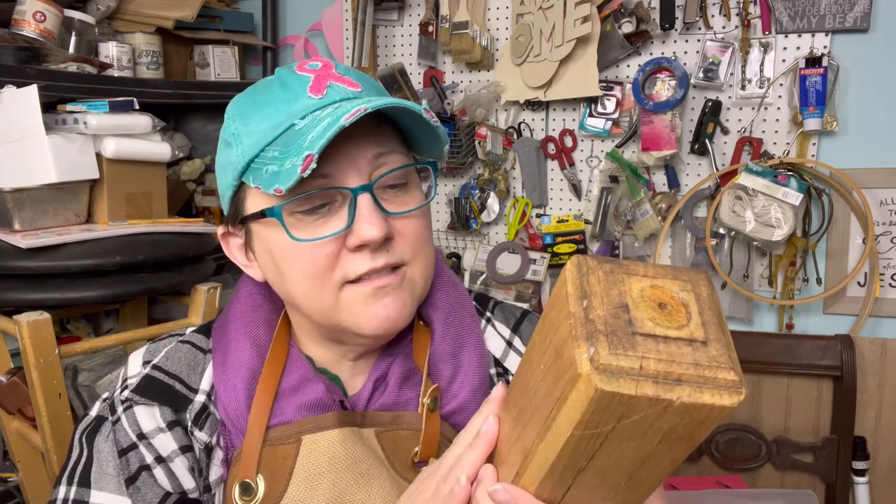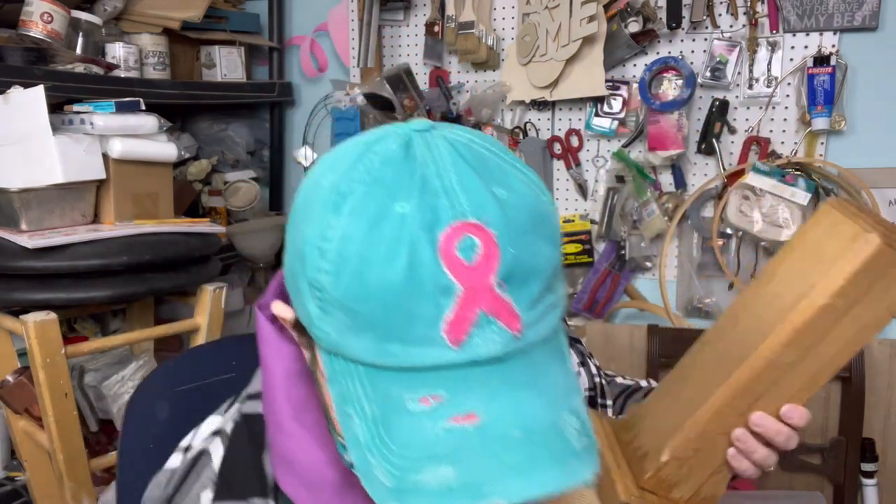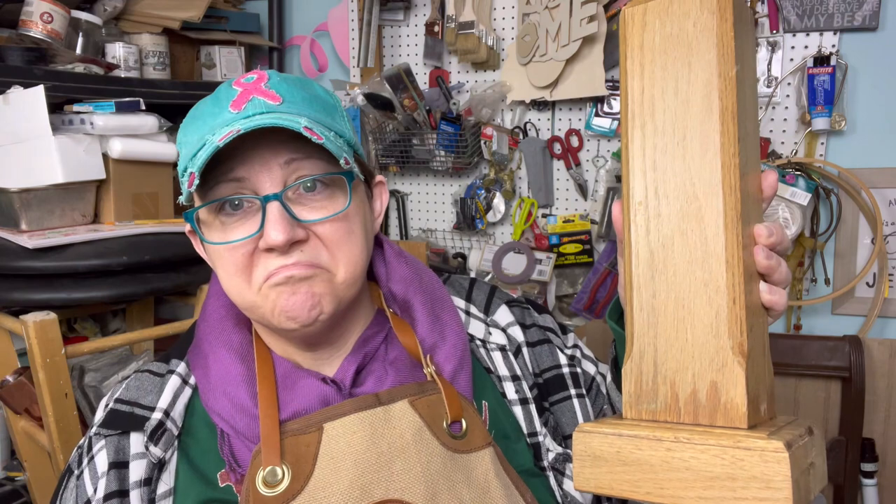When I'm done with that, we'll give it a good sanding after it dries and base coat it. It's dry now, we need to sand it. It does have a stain and a clear coat on top, so I'm just gonna take my palm sander and sand it all over - give it a really good sand. I'm gonna sand the whole thing so our paint has something to bite into. I realized that a lot of the all-in-ones say you don't need to do this step - you will never be sorry you prepped the surface.